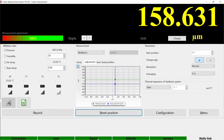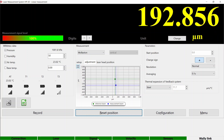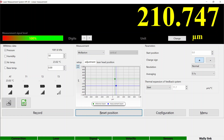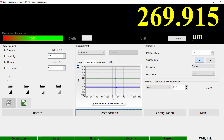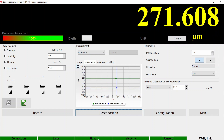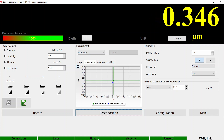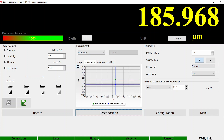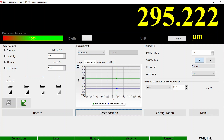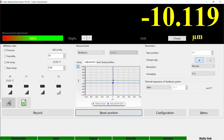Here is how it looks on the screen. If at some points the signal is lost, you should readjust the Wollaston prism. The signal should be 100% during the whole route of the axis. The two dots on the screen can move, but they should be within the compensation range. The less movement you get from them, the better.